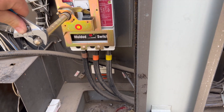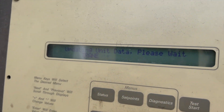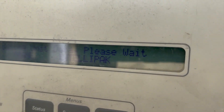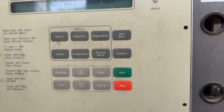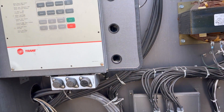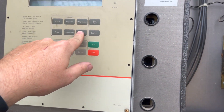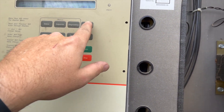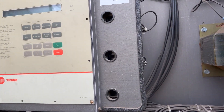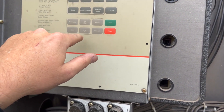Okay, we've got to wait for this thing to reset. Then we're going to go into test mode and go through our circuits. When we get to the K12 circuit it's going to sound terrible. We'll go with service mode, hit test start — it'll count down and then the blower will come on. Then we'll hit service mode again to get ready to turn on the compressors.